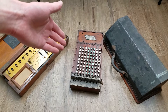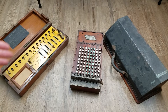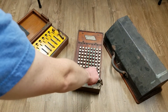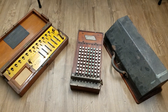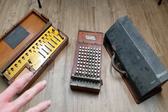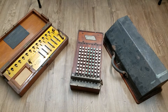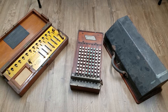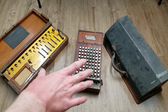In contrast, the comptometer has buttons — keys — for input instead of sliders. It has no action cranks, so as soon as you push a key, something happens in the register. So pushing the one, two, and three keys immediately shows one, two, three. This makes it faster for direct adding — if you have a long list of numbers to add, you can punch them one right after another, versus the arithmometer where you'd set the slider, turn the crank, set the slider to the next number, then turn the crank again.